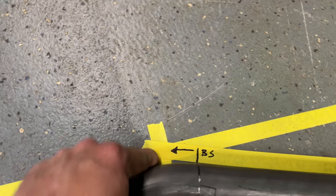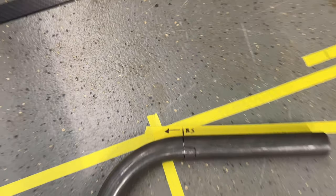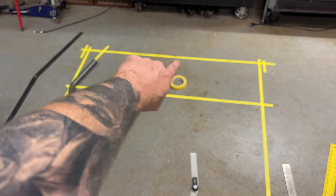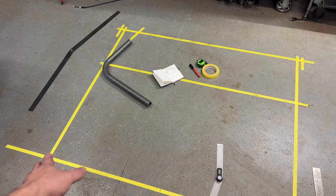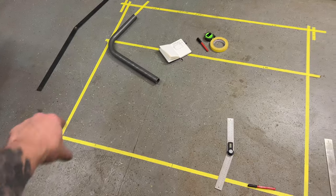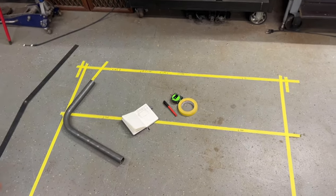And then once that touches out here, that gives you your new bend start to go from this way, that way. So rough measurement told me that from center of the roof down one side was about 5.5 feet. If I give myself some wiggle room down here, I'm gonna call it 11 feet, find center, and then that's where I'll start doing the bends.